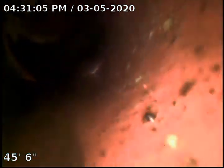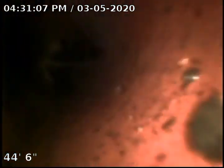We'll recommend that after he does the Root X treatment, maybe coming back in the fall and just dropping a camera in this line, making sure everything looks good. Nothing looks too bad — just slight separations on the fitting, but that's pretty normal with these old clay systems. As the ground settles, that pipe just kind of wants to pull away. These lines were pretty sludgy too, so we knocked out quite a bit of that with the descaler.